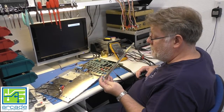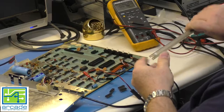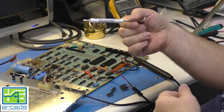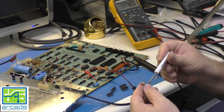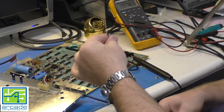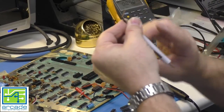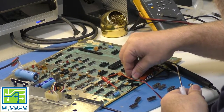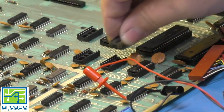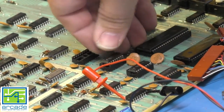Found a tube of TMS 4027s - these are equivalent to the RAM that's in there. And a chip lifter - these are easy to make. You just take a little screwdriver, put it in a vise up to a point to heat-sink it so you don't melt it, then heat the shaft and bend it over, and it makes a great little chip lifter that gets right up underneath the socket. The TMS 4027 is a 4K by 1-bit dynamic RAM chip.